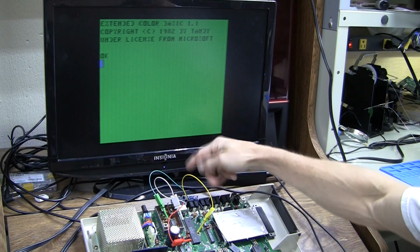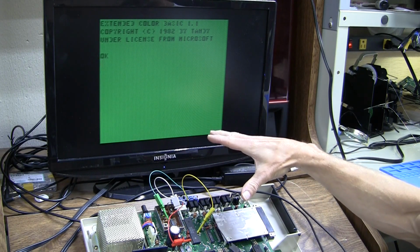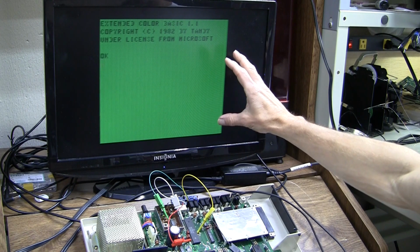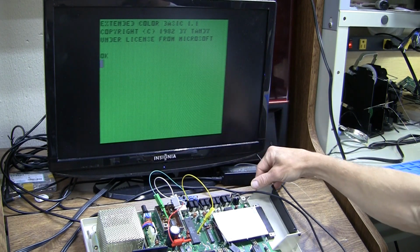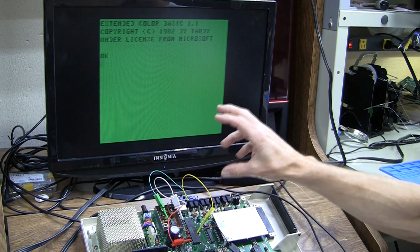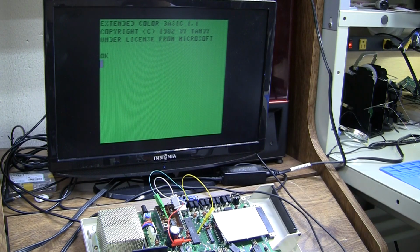When I moved the board, I found one resistor had completely fallen off, so I wanted to make sure that everything was still okay. And so I resoldered the resistor, and I reconnected to make sure everything was still okay. So yeah, it's still good. If anything, I think that component helped the picture a little bit. So at least it's no worse. Okay, now back to the bench. Remove the RF modulator, place the composite mod back in its place, and I'll be right back.